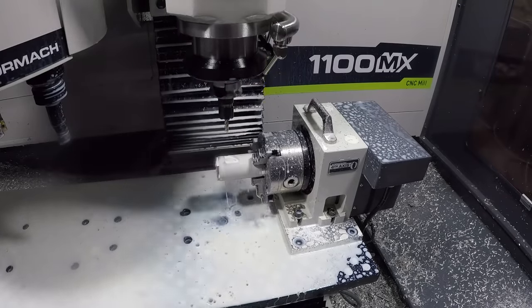The other exciting simultaneous 4th axis toolpath is Flow. We've got a part modeled with a spline — a great example of a feature the wrapped toolpath cannot handle. Flow will work for this. To access it, enter beta mode with Ctrl-Alt-C on your keyboard to open the text commands, then type cam.betamode on. Then select Multi-Axis Flow, choose your geometry, and under Passes enable Multi-Axis, then set 4th-axis limit. You'll get a warning because it's in beta. Change the tool orientation and set the Z-axis to the direction of your A-axis, and you have a true 4th axis toolpath.